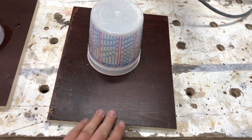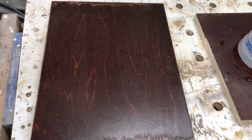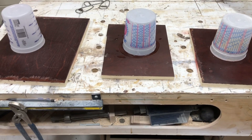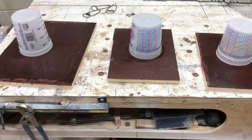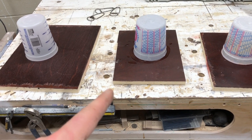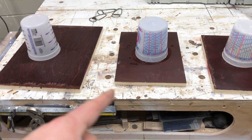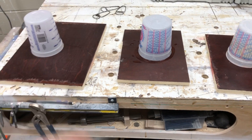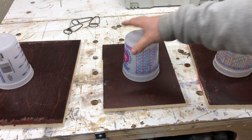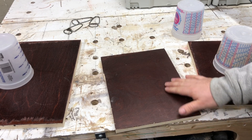We're back. The CIC conversion varnish water base self-sealed has no water on it. The vinyl sealer is still holding water. The Malacy 2K poly - the water is off of it. I've done this test about four times and every time the vinyl sealer is still holding water. We'll come back tomorrow, but I'm pretty convinced the vinyl sealer is going to help you with water issues tremendously.